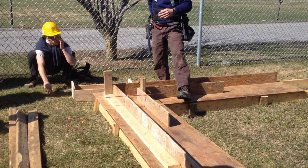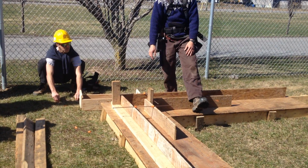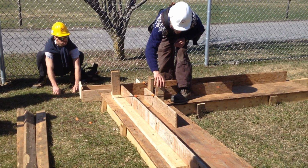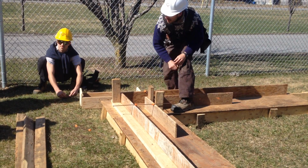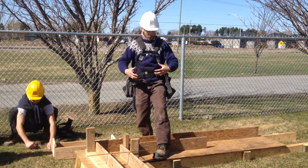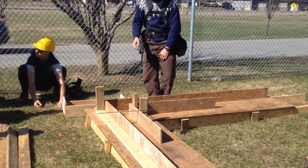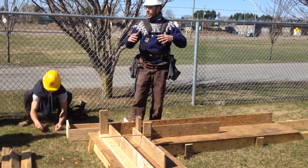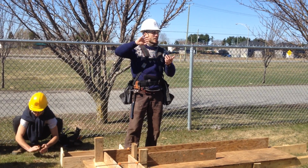But if we wanted to do it mechanically without the tape, I would say I want to get as close as possible to this inside corner, and I need to leave room for the stud, because past each rod there is a stud, and I also need a little room to put a wedge in there, right? But this will come by doing and doing and doing. So 3 inches is a rule of thumb. I'm not giving you any measurements from the inside to here and the inside to there, because on the exam I will trick you. I'm going to give you different size rods, so it's going to change your inside pattern, and we'll prepare for that. Leave this for the future.